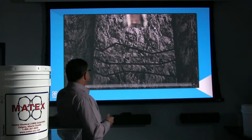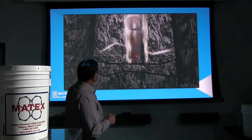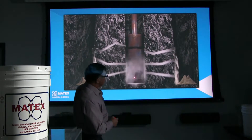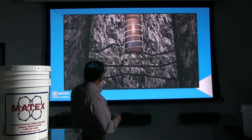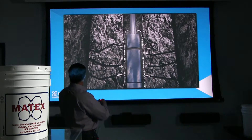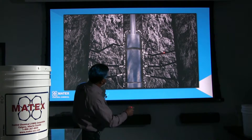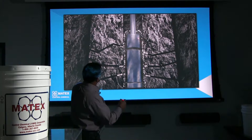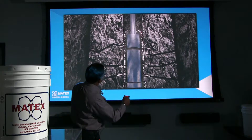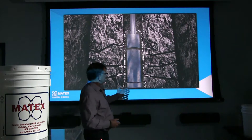This is a neat animation here because we're drilling with a very large down hole hammer. When you're drilling with a larger down hole hammer, your pipe size is quite small in comparison to the size of the hole for larger piles. You can see the communication from the holes going from this hole over to maybe one of the other holes. There's another hole drilled here and a hole drilled there. When the air is communicating over here, you're not getting your uphole velocity. In this case, we just have a bucket here to catch the cuttings — you want your uphole velocity sending the cuttings up into this bucket so they can pull the bucket up, out of the hole, dump the bucket, and continue on.